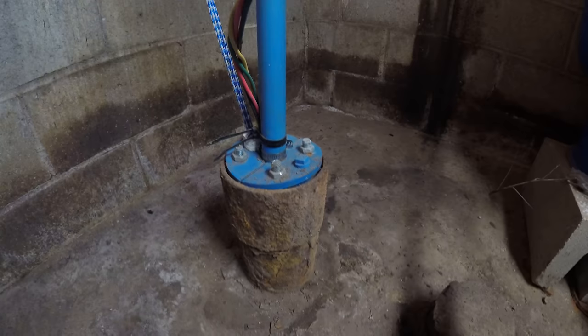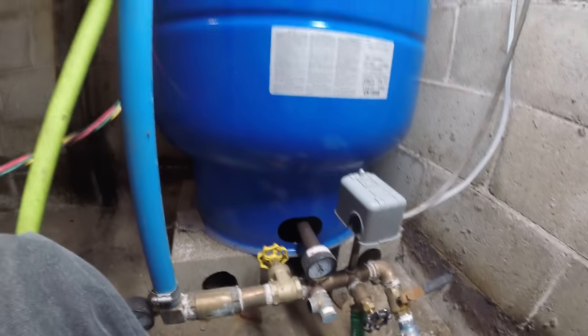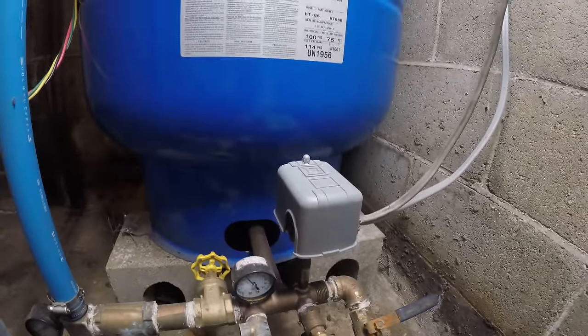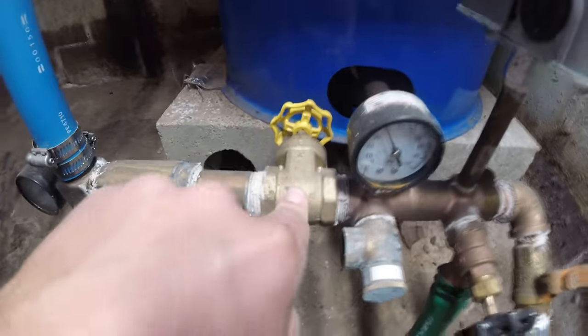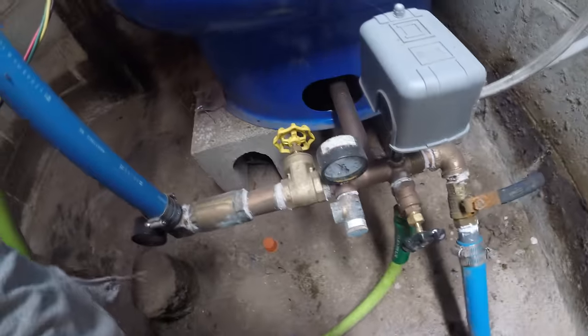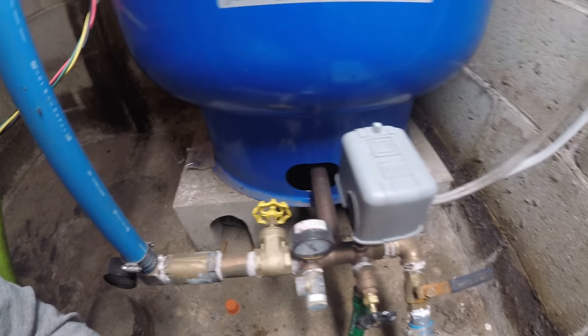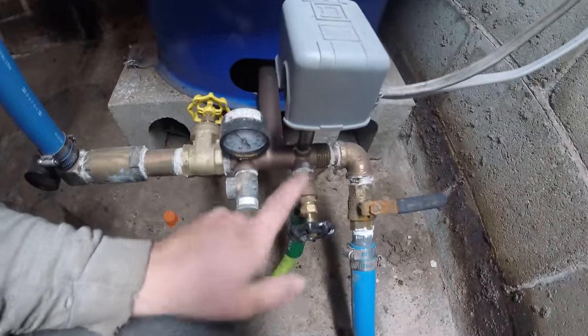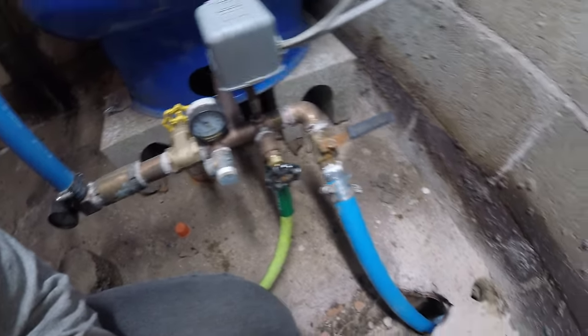Pretty cool well house. There's the well casing coming up right there. I put a new submersible pump in here a while back — I still have a couple things to finish up, but it's been working really well. Here's a new pressure tank that I put in as well. There's a pressure switch that controls the well, a pressure gauge, check valve, a gate valve with a hole drilled in it to reduce flow — because the flow was too much initially. Coming out of the well you want the pump to pump at a certain GPM so that it doesn't over-pump. And then a relief valve, another pressure gauge, a boiler drain, and that's what my temporary water is hooked up to right now.